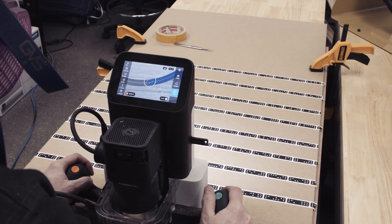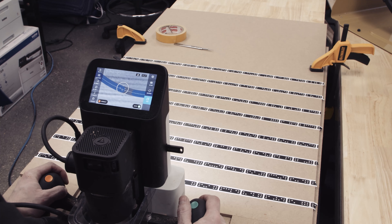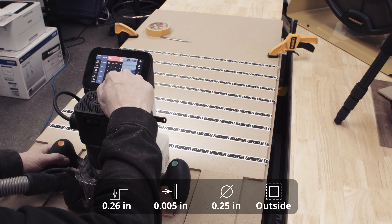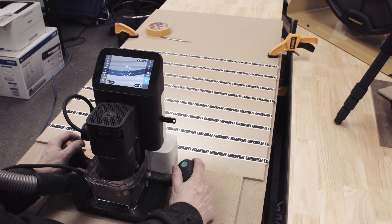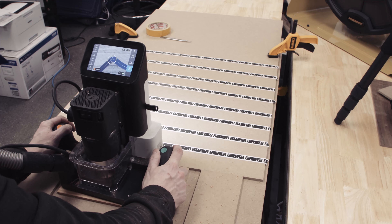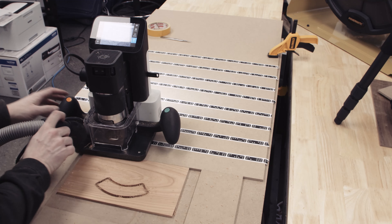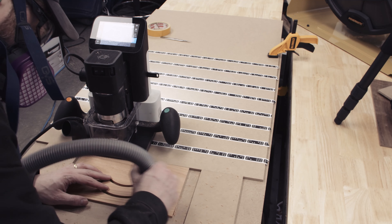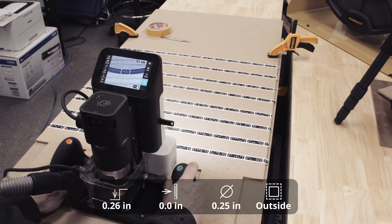At this point I realized the shape has no sharp inside corners, so I can get away with using only the quarter inch bit and cut through the piece completely. This pass cuts through the piece using 0.26 inches for the depth, still using the 0.05 offset. For the final cut, I'll remove the offset, trimming away the extra material.